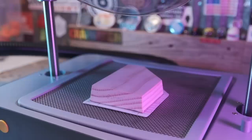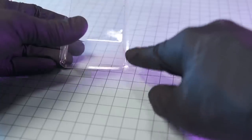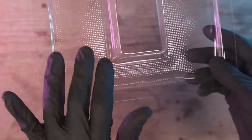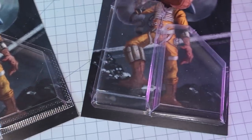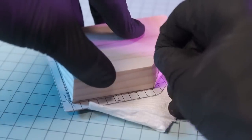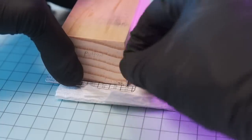So with vacuforming, one thing that you might run into is webbing. That little fold right there, that little wrinkle out in the corner. And so there's a number of reasons why that is. I went through several variations and tried different little things. I tried to poke some little holes in my little card stock flange so I could get better suction right there, through this little hole right there.